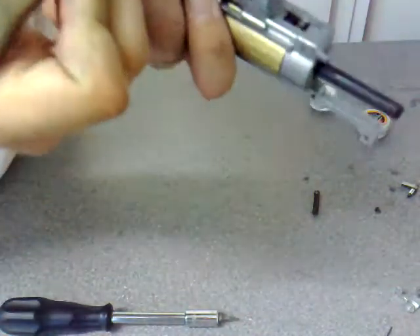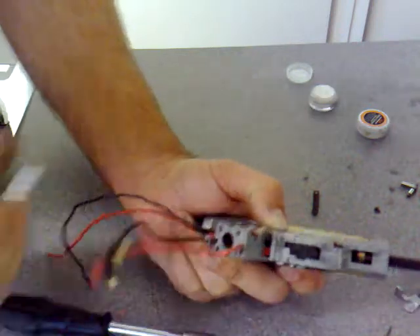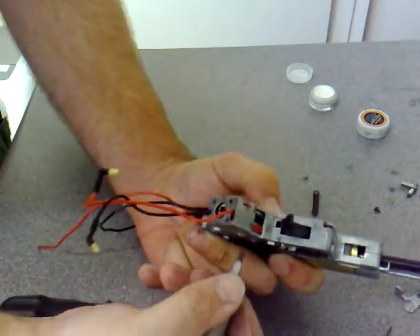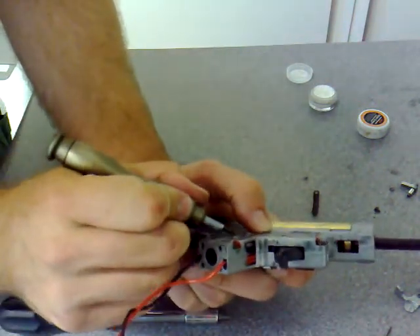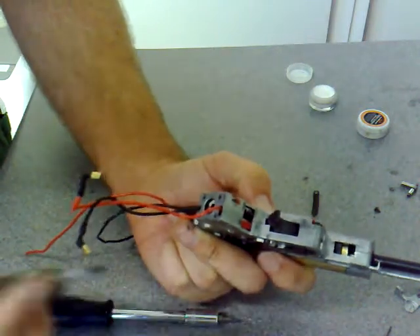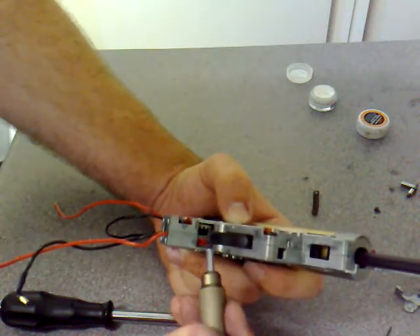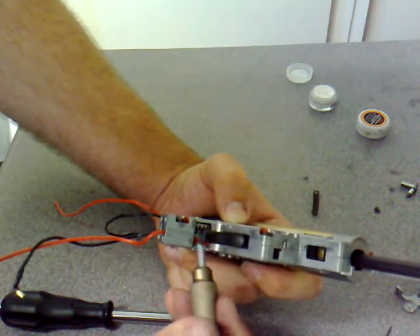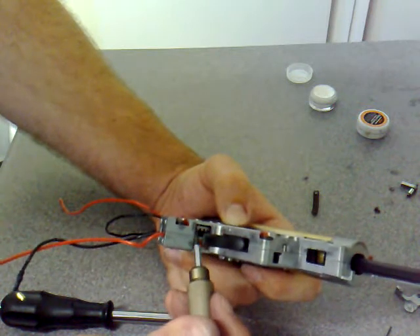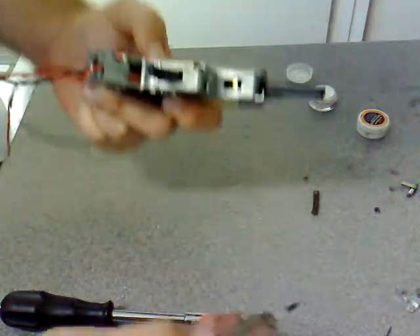So it's tight. Now we check the height — is there any movement? We've got 0.005 movement there, which, as I say, you want tight, ever so slightly — you don't want it too tight. So we know for a fact there's not any sort of excess play, which is what you really want to get rid of. And we know for a fact that just moving this here is so effortless. The only thing stopping it here is the piston that we've left in, which we probably should have taken out just to check the overall speed of it.